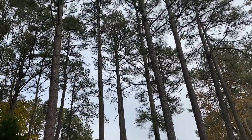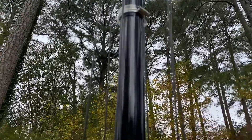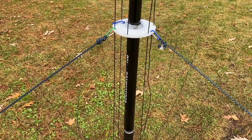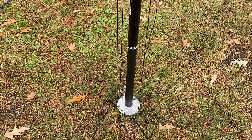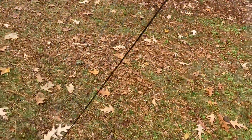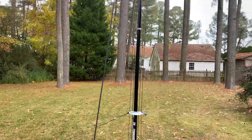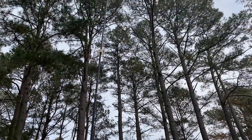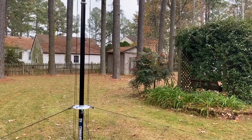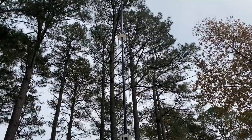It's actually a pretty straight shot. I did some testing on this antenna and I'm going to post more results, but so far so good. I have this side of the antenna not only supported there, but I also have a separate support going up to where the 80-meter leg runs off to the tree, pulling it in that direction to help keep the antenna up straight. I thought it was a pretty good addition. I'm not sure how doing a 40-meter inverted-L instead of coming back down the tip the way Callum does would affect it.